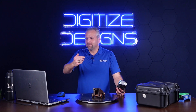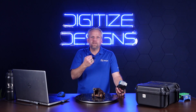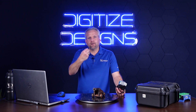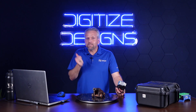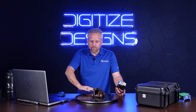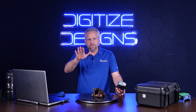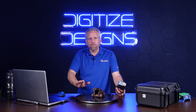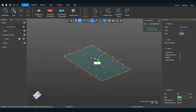I talked about the advantages of going ahead and doing the marker point scan ahead of time. One is you do increase your accuracy because it allows the program to run through that optimization routine you just saw. Secondly, it allows us to set up what's called a clipping plane — a plane at which I can basically select this table, so nothing below the table will be recorded. So we're going to do a background plane here. I just select a few points here and set that up. That's how easy it is.